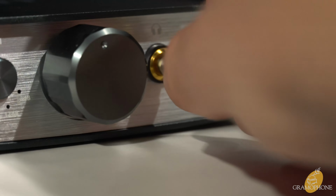And to get into some other numbers, this is rated for a frequency response of 20 Hz to 20 kHz, that perfect 20 to 20 of human hearing. With the ability to deliver 15.1 volts even at a high load of 300 ohms, this thing has the power to push just about any headphone to absolutely bumping levels of volume.